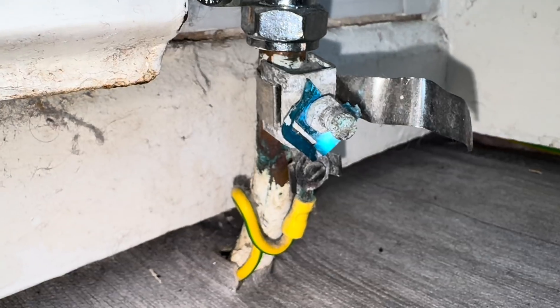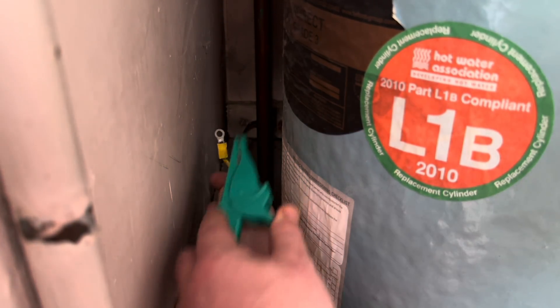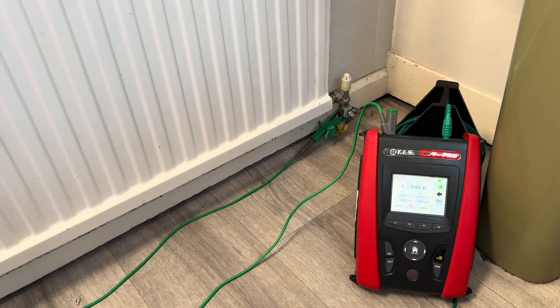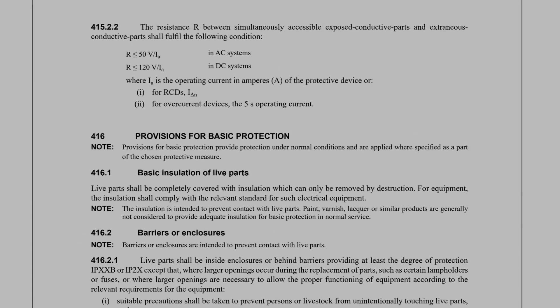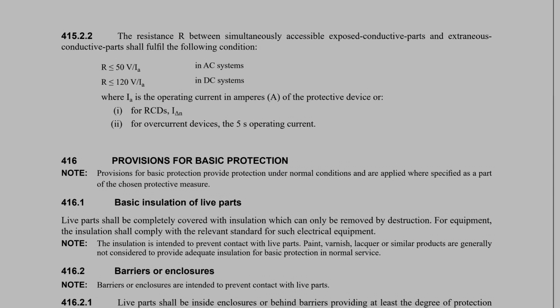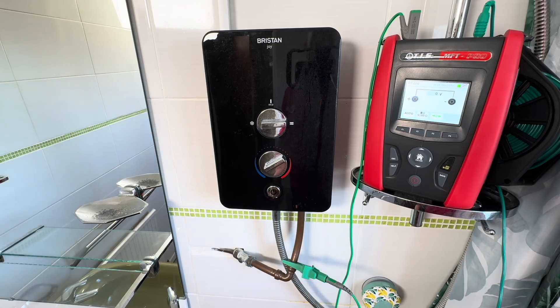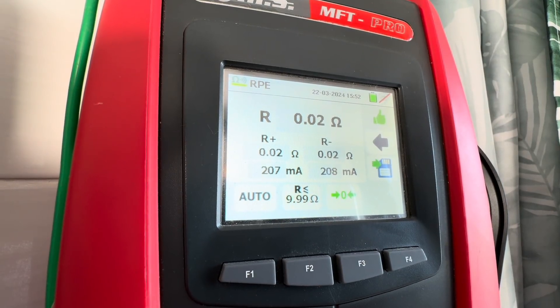I am using test method 2 to test between each metal part. The problem is I have a radiator where all the pipework has been painted, so I'm going to have to find a discrete spot to remove some of the paint to make sure I get a good connection. We are not given any maximum permitted values in ohms that supplementary bonding needs to meet, but we do need to ensure that the level of potential that could rise in exposed and extraneous conductive parts is less than or equal to 50 volts. Regulation 415.2.2 gives us the formula: resistance must be less than or equal to 50V divided by Ia, which is the minimum current required to disconnect the protective device in five seconds. In my bathroom, which has a shower circuit supplied from a 40A MCB, I can look in appendix 3 of BS 7671, which tells me that a 40A B-type MCB will trip within five seconds at 200A. Throwing this into our formula, we get a resistance of 0.25 ohms, so I need to ensure my supplementary bonding is equal to or lower than that reading.